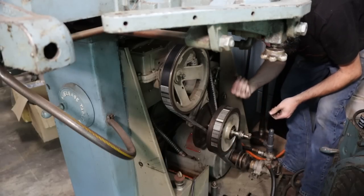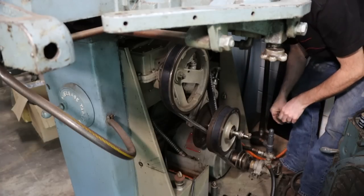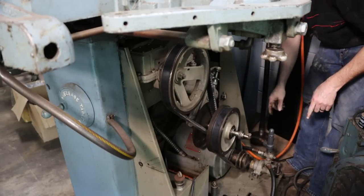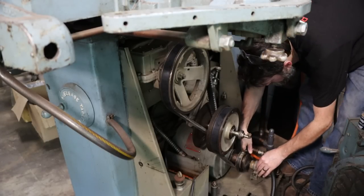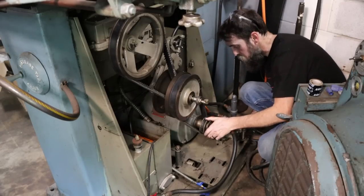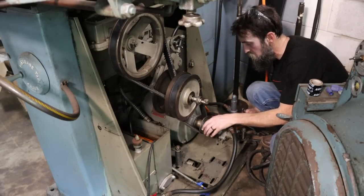And this saw is unplugged, so it's safe to work on. There we go. Those two belts changed. Now let's get the small hydraulic belt back on it, and then our belt swap will be complete. Making sure that this pump and pulley is straight with this one.